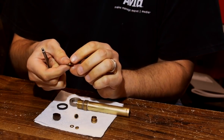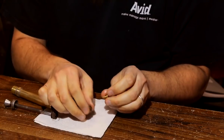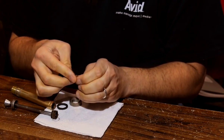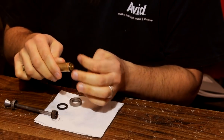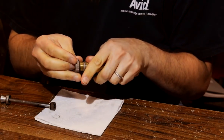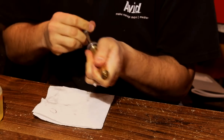The plate behind the pump leather has a flange for the leather to ride on, so make sure the flange is the right way around. The NRV is a common trouble spot — it sits submerged in fuel, so if it leaks, fuel floods the pump tube. It's important that the NRV works correctly, as we'll see later. Don't forget the rubber seal on the pump tube. With the pump assembled, check the function — you should be able to hear air pass through the pump and hear the motion of the NRV.